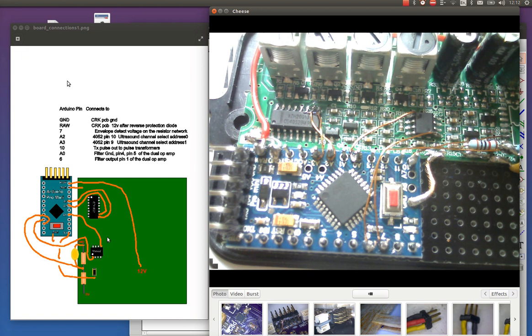I've tried to make this relate to the schematic, so here's the Arduino and these are the connections. First thing to note: you've got your ground — I've got two ground connectors on the Arduino and you need to try to get them onto the ground plane of the circuit board. There's one going down there with a double bit of wire and a thick bit of copper wire. You can also just not fit those and leave a little slot there to get more ground wires onto the ground plane. Really, the more the merrier — the better it's connected to the ground plane, the better this will work.